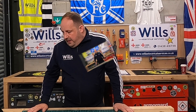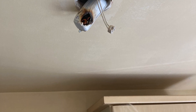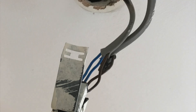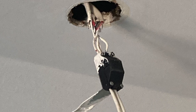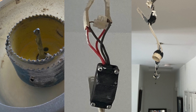For downlights, one of the main observations is whether they're fire rated or, if they're open-back downlights, whether they have the correct fire hood fitted — which is rare as rocking horse. That applies upstairs and downstairs; if there are habitable rooms above it's a bigger issue downstairs. Also check whether it's in an apartment block with a concrete ceiling above or combustible material like joists. Make sure there's no basic insulation visible outside the enclosure at any connectors — we see thermal damage especially with old 12V ones.